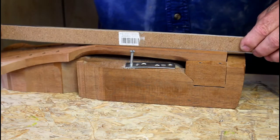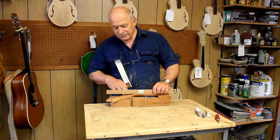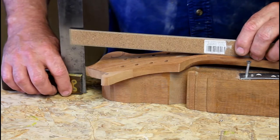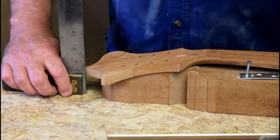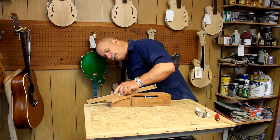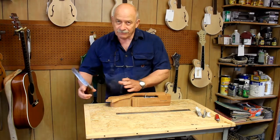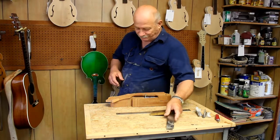Now you have this slope on this piece of neck wood, and so when you run this thing through the bandsaw to saw this shape out, obviously now all of these angles right here are going to be at 90 degrees to the tabletop and not 90 degrees to this surface, but to this surface. So that is a key factor in how to position these tuners on this peg head.